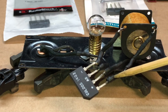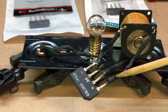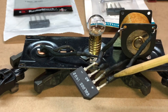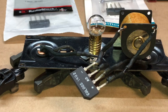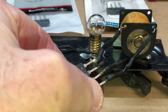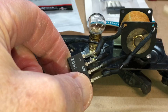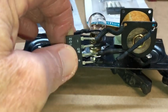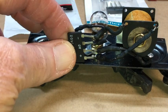Then I simply place them against the pin, fold the pin over on the wire, solder, and then put shrink wrap on top of that. So every joint now is covered in shrink wrap. Now, a good bit of the work in doing this, one is extracting the chassis, because the brakeman has to be bent a little bit, his platform. And then the other one is going to be tucking this into the car.